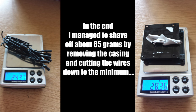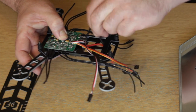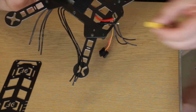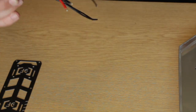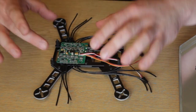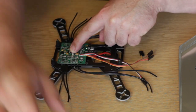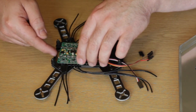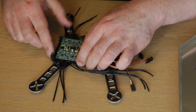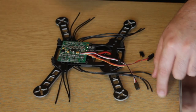I'm going to put the two power leads through the bottom and then pop an XT60 on there. Also, to protect the Qbrain from vibration — bearing in mind this is the dirty plate — and to make sure it doesn't come loose and vibrate against the top plate, I'm going to do a little seam of hot glue along here and along here just to fix it nicely in place and stop it vibrating about.